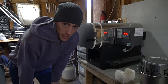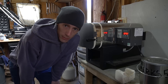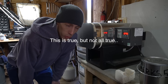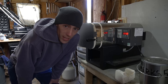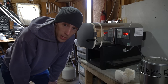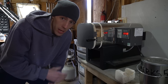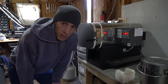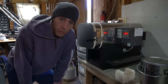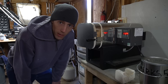In my mind, this test is pretty clear — clear as day as to what is going on. Soaking time at temperature for this particular steel, 1095, is critical. As far as grain structure goes, you do not want to soak this for longer than you absolutely have to. So the next test is going to be a temperature test. We know that five minutes is about the optimal soak time, so we're going to normalize three pieces to start with even grain structures, then do a temperature test: the first piece at 1425°F for five minutes, the second at 1475°F, and the last at 1525°F — all with a five-minute soak period.